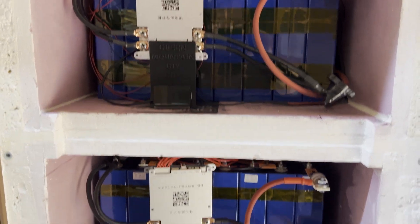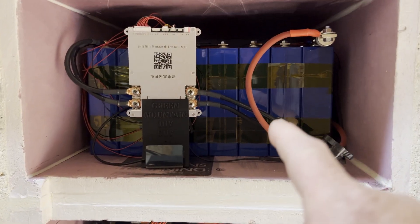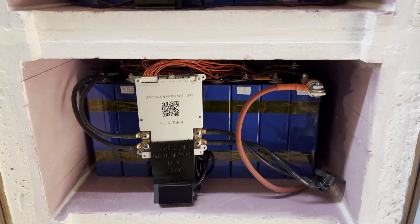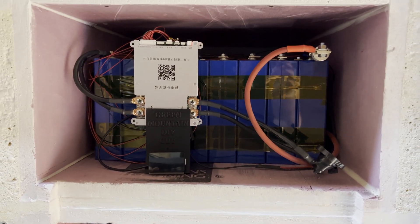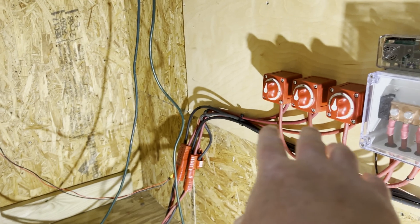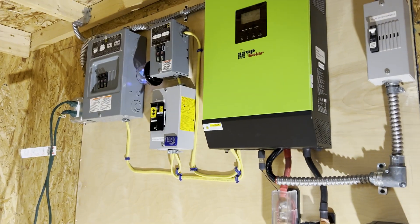I just finished setting up the new batteries, which are on the middle rack of the battery cabinet. I have my batteries from last fall — again these are 230 amp hours — and 230 amp hours on the new set, with space for more batteries in the future. I can also go back further in the rack and add a whole other set, so I can do quite a few batteries in this insulated cabinet. These batteries connect back to Anderson power poles, come out of the rack to more Anderson power poles, then go to my battery switches — three sets for one, two, and potentially three banks — then to my bus bars and up to the rest of the system.